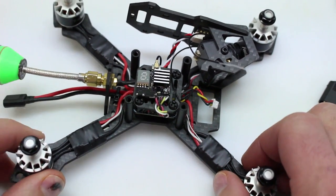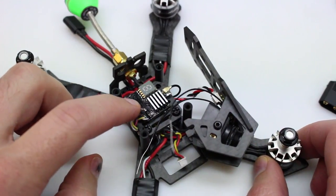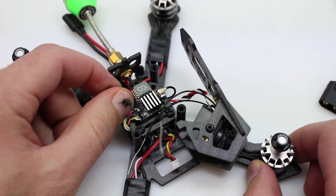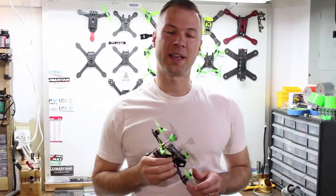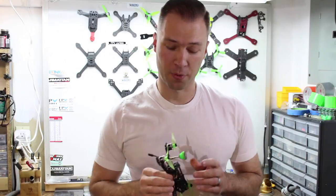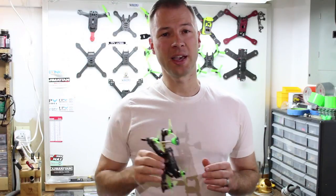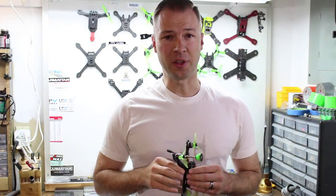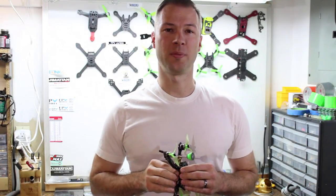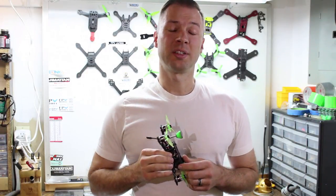So is it worth putting heat sinks on your VTXs? Maybe. I would say if your VTX is running over about 60 to 70 degrees Celsius, this would actually probably be a good idea to help bring it down a bit. I hope you were able to take something out of this video. This was not my idea — it's something I've read about before and really wanted to try and put on video for you guys. If you liked this video, give it a like, and please check out the link below to racedayquads.com. I have an affiliate program through them and they're awesome to buy from. I am Corey with Crash Band Racing — thank you for watching, see you next time.